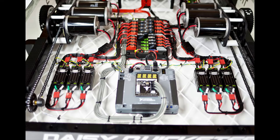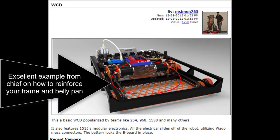You can also use the belly pan to mount electrical components. If you intend to use the pan structurally to attach other parts, stop and think about this carefully. If your belly pan is an eighth of an inch thick, be careful when you plan to bolt heavy things to it, especially if you have a split belly pan, because if you bolt something too heavy to that pan, it's going to flex and make things on top bounce.